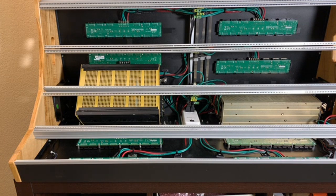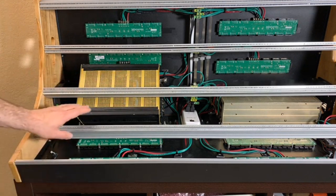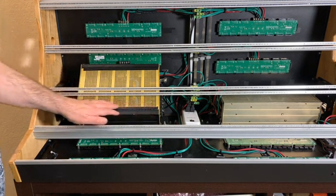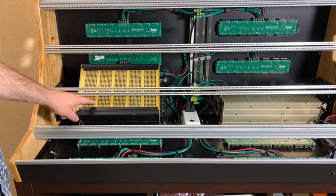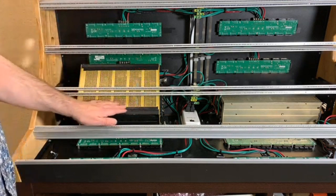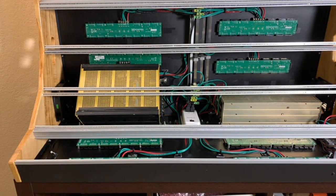Sorry, Chris. Let's continue. So we were talking about module depth, and that's looking like where that will be an issue, that massive diagonally mounted power supply. It's quite close to the rails. So I made a point of putting slender, skiffable modules here where it's going to get the closest to the rails. Mutable Instruments modules are very thin, as are many surface mount modules, but there's no way I'm going to get a through-hole module like an LB or a Doepfer or an EMW here. There's just not enough depth. It falls away here, and it's not too bad here, but then the rest of the places, I have plenty of space. But this was another consideration, I had to think about what modules went where this power supply was. It was a lot of thinking ahead of time.